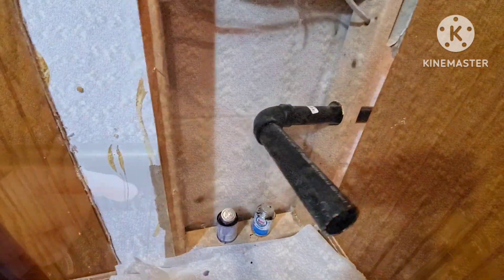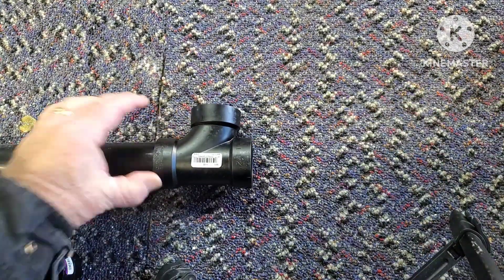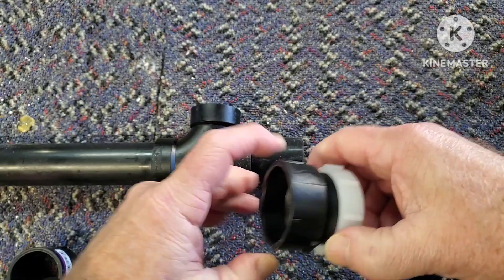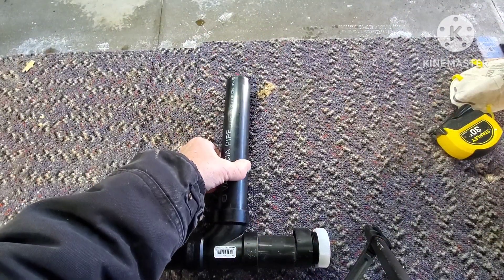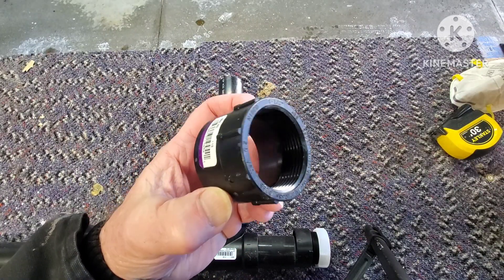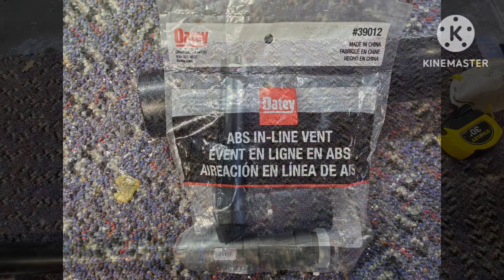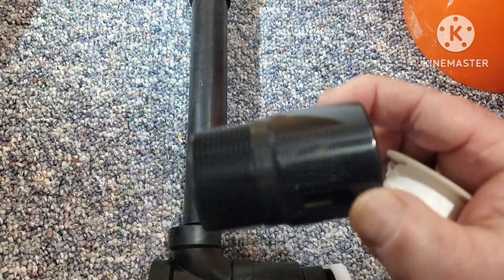That's pretty much it for the rough in. I'm going to mock this up for you so you can see — the left side of that pipe would be the wall. I've got a sanitary tee coming off of that inside the cabinet, then a short stub of pipe and an inch-and-a-half adapter for the sink drain to go into. The top half of that tee, I'm going to put a piece of pipe with an inch-and-a-half female adapter with threads on one side up inside the cabinet to receive this inline vent up under the sink.